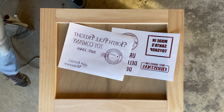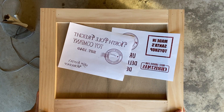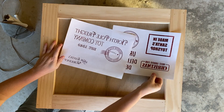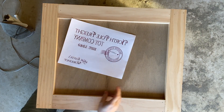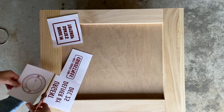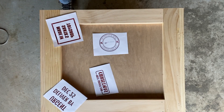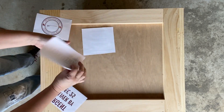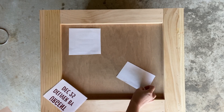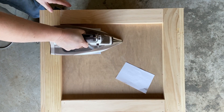Now I want to show you a couple different ways that you can apply stamps to your shipping crates. These are my printables — these particular ones are in red. This method will work with a very light stain or with an unfinished or natural crate. These are laser printed and they are in reverse. This method must be done with a laser print. Prints with really fine detailed lettering are not going to work very well with this method. Also this method is not great if you plan to use any type of coloring in your stain — if you plan to use anything other than a very light stain, you can jump ahead to the next technique.